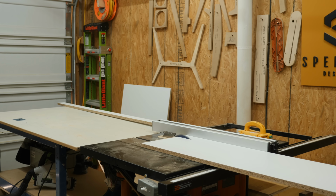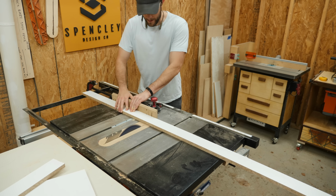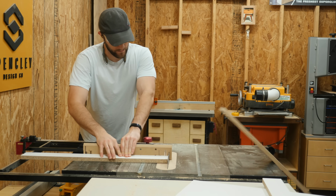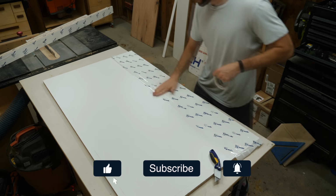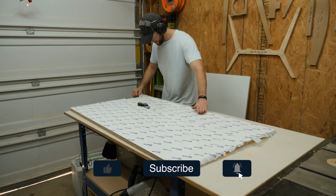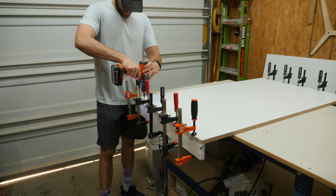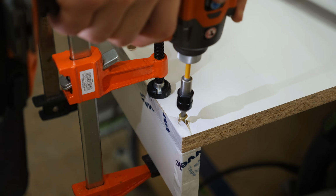Anyway, to hold all the epoxy in, I started building up an epoxy form out of melamine. And to make sure that there was zero chance the epoxy accidentally fused to the surface, I covered everything with this waterproof sheathing tape. After pre-drilling and countersinking, I could fire in a few screws to help hold the mold together.